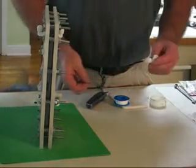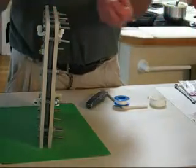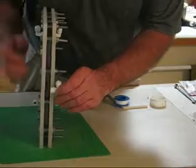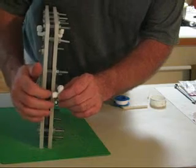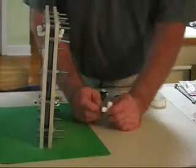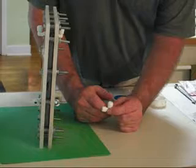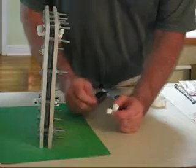Since my sandwich boards are so thin, these quarter-inch threaded taps — national pipe threads — were a little bit skinnier than the test plug I used. They protruded through too far. They have a nice ridge right here; it should go to there. They went through too far, so I chucked them up in a 16-inch Jorgensen wooden screw clamp and then chopped them off with a chop saw to shorten them up. So they're about an eighth of an inch shorter than they should be.